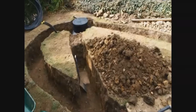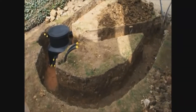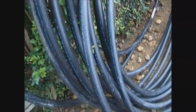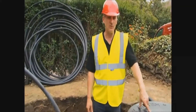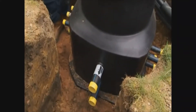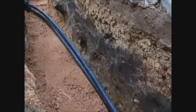The next part of the installation involves digging the trenches down to 800mm, putting in a bed of 100mm of soft sand, then installing the pipework. Here you can see the main manifold sat in an 800mm trench that will take the pipework from the ground source loops and supply the heat pump within the property.